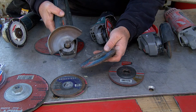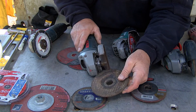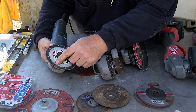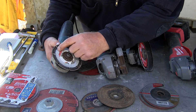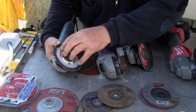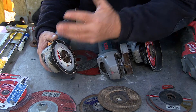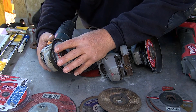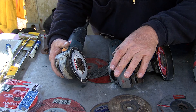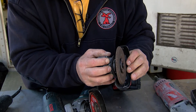A lot of people will try to interface this five-inch wheel with a four-and-a-half-inch angle grinder. As you can see when you put it on, it's going to hit the guard. On this angle grinder, there's no guard — this becomes very dangerous because if one of these blades hits something or gets stress-cracked from the heat, they'll tend to come apart. Same with your composite wheels. If you don't have full-face protection and a rated full-face guard, I would strongly recommend not taking the guard off. I see people do it all the time — I don't recommend it. I like to have the guard on the tool itself. People just get tired of the guards moving around and want to take them off, but it's just not a good idea.